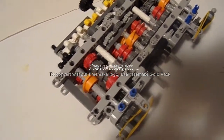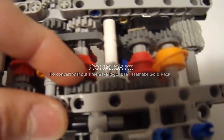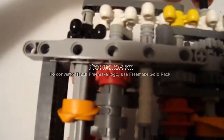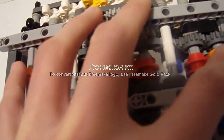Here's the latest semi-automatic plus reverse dual clutch sequential gearbox. This is the input for shifting — it shifts the top clutches and simultaneously shifts the ones below. When one input is engaged, the corresponding output is engaged on the other side. As it turns, it cycles through the stacked gearboxes: one, two, three, four, and reverse on one side; one, two, three on the other. The ratios are the same, but the two clutches have different ratios — here it's 16-to-20 rather than 16-to-16. It can shift by switching between clutches even when they're on the same gear.